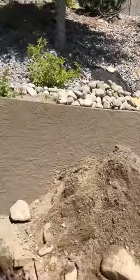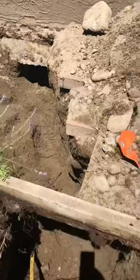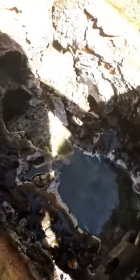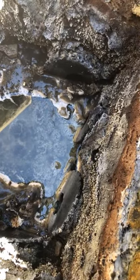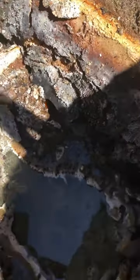You can see the tank up above with piping down below. We've excavated the distribution box, and as you can see, everything's completely plugged right up again. This is causing a short circuit — it's running from the septic tank going down basically just into those two lateral sections, as you can see here — totally caked.